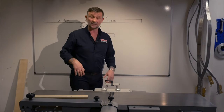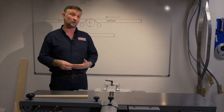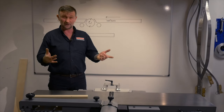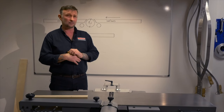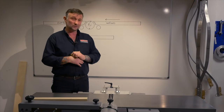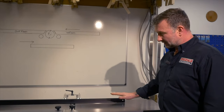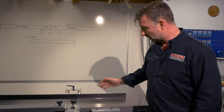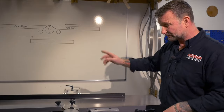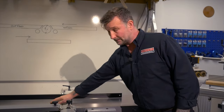For this, you'll need a kind of reliable straight edge, really. It can be a shop bought proper straight edge that you know is straight. Maybe a nice, clean, straight-looking, undamaged spirit level, but just something that you think is straight enough for you. So I'm going to bring my infeed table up to the same level using my normal surface planer adjustment. I'm going to bring this up to the same level as my outfeed table.